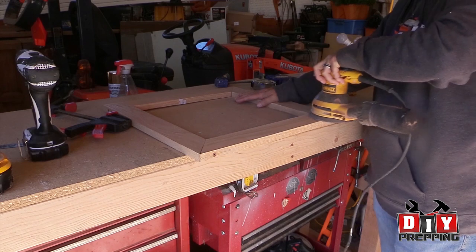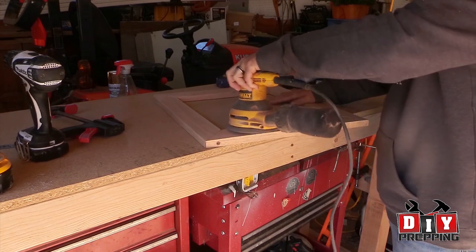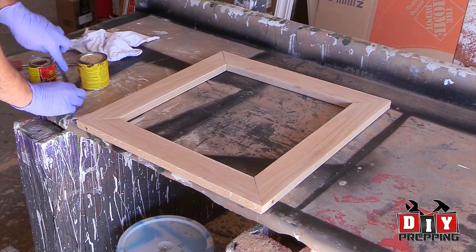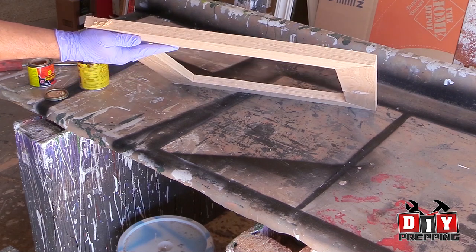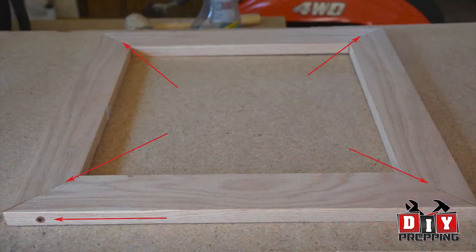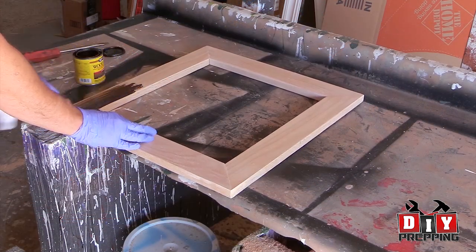After that I just sanded everything - use a really fine grit sandpaper and make sure to get all the rough edges out, because after this you're going to apply some stain and polyurethane and you want a nice clean surface. With the screws and the corner seams, I put some stainable wood filler in them. It's not like regular wood glue - you can actually stain over this. You can still tell a little bit, but it's not nearly as glaring without it. Make sure and fill in all the crevices and cracks.